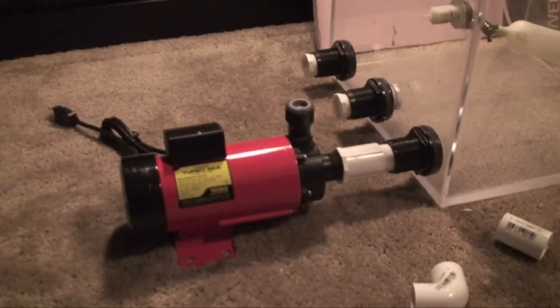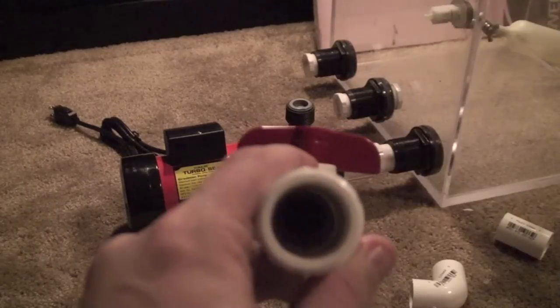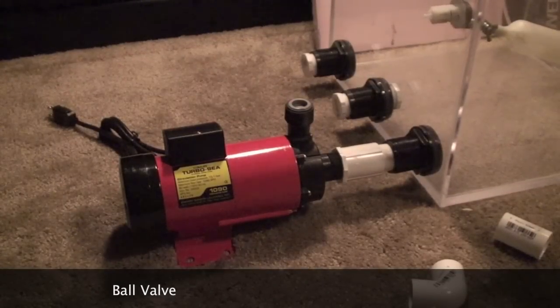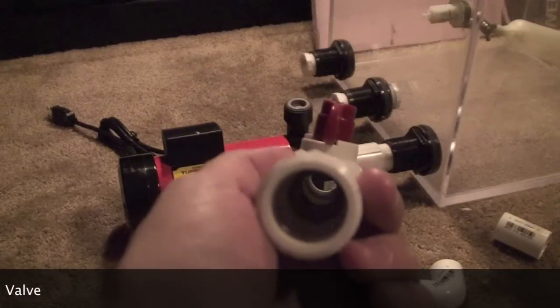What I need to do is use a valve, and the valve choice in this situation is fairly important. This is what people call a ball valve. You turn a little knob here and it cuts off the water flow. But I find those to be a little bit difficult to use even when there's just a little bit of water going through. Plus, if you get a snail in there — if it's already difficult to turn — say you get some little creature crawling in there, your chances of closing that valve are going to be slim to none.